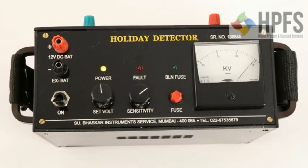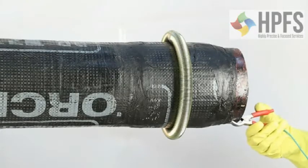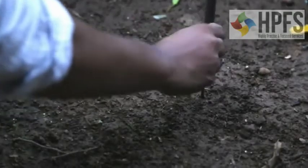The offset voltage of 4KV may change depending on the situation at the time of testing. Humidity and dielectric strength are the major factors governing the offset voltage magnitude. Before starting, connect the green wire having two crocodile clips — one end attached to the metallic portion of the pipe and the other end to the soil.